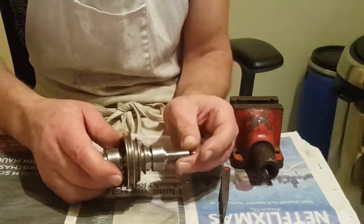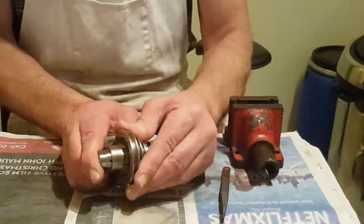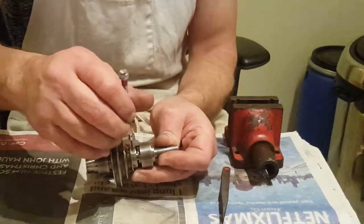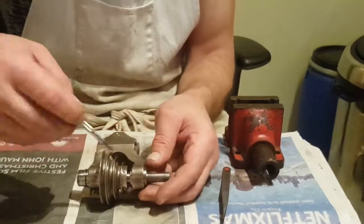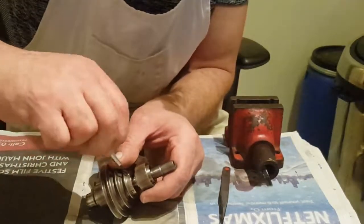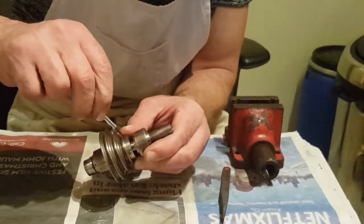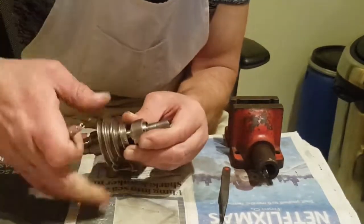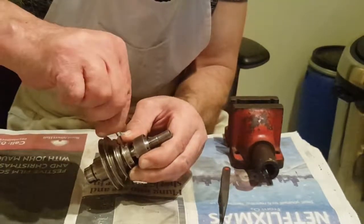This end will usually be hardened; the rest of the spindle might very well be soft. Some of them are hardened all the way through. So, with that pulley tight up against here, I only have one screw — this one's got four. Let's do these up. Tighten those up as much as you can; the last thing you want is the pulley to slip on the spindle.